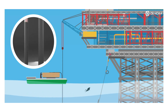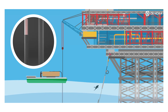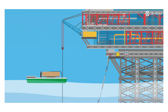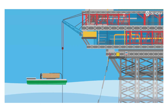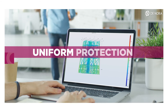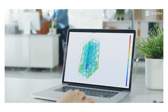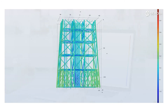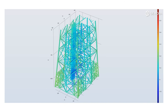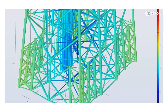The diver installs the TSA stainless steel protectors in correspondence of the splash zone. The LIDA cable bundle is moved to the positive junction box and protective tube installed. The TSA is completely applied on the jacket, meaning that the whole structure is now protected. No under-protection can be found in any single element of the platform; the protection conditions are uniform.